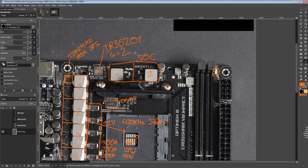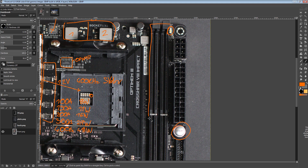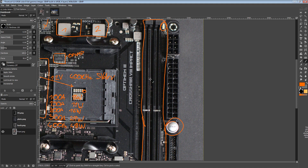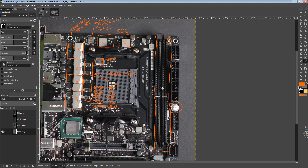Some heat will obviously also be cooled through the front of the board. VRM-wise I'm a huge fan of this motherboard. This is one of the reasons it's a top two X570 board for me — you get a great VRM, all of the extreme overclocking features, and only one DIMM per memory channel, which can significantly help when pushing raw maximum memory frequency.